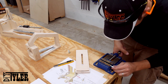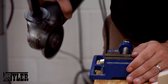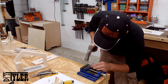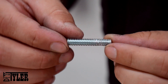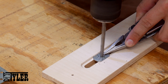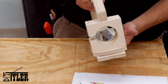Referring back to the most ingenious part of these plans — that v-groove that allows the pivoting motion of the router itself. Right now you need to make a threaded insert and then a unique shaped washer that threads through a part of your portable mortise plate into this v-groove. You need to hammer down the top of it so it doesn't thread all the way through. Then you make this goofy-looking washer that slides in that inset groove in your plate, and this is what you adjust back and forth to change the width of your mortise cuts.